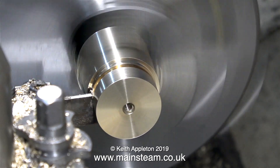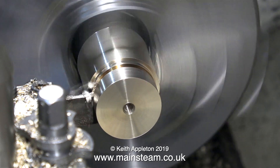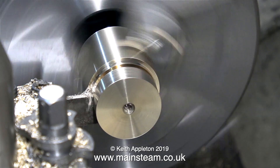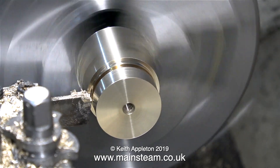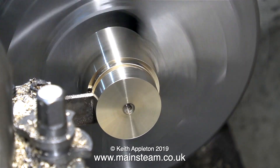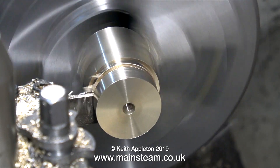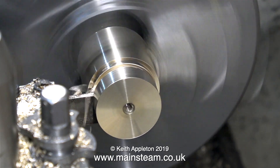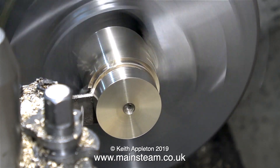If you look carefully you will notice that the chuck is still slowing down when I put a lot of pressure on the work — probably because the belt dressing has only just been applied and the solvent has not yet evaporated; time will tell. What I need for this Boxford lathe is a special segmented belt, and I've found a supplier where I can get one. Hopefully when I fit the new belt I'll make a video about doing so.